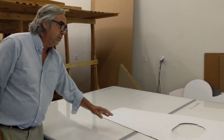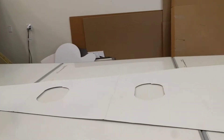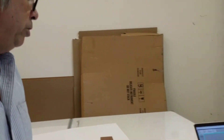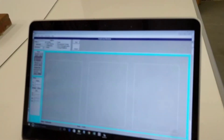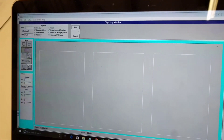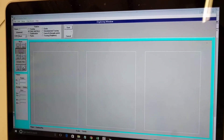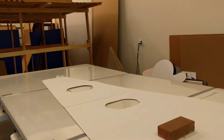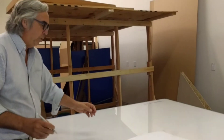I'm going to digitize this with lines and arcs. I've got two straight lines at the top and the bottom and an arc on the two sides. I've got some inside holes I'm going to digitize with lines and arcs. I come in and I start our software and I click the digitize button on the side and I'm going to tell it that I'm going to digitize this with lines and arcs, then I click start and then I take my pen stylus and I digitize points on it and I tell the software if I'm going to connect those with lines and arcs.